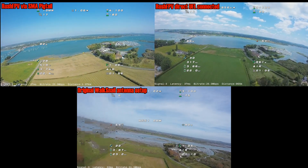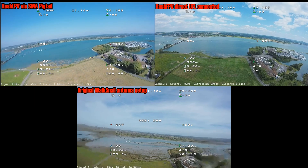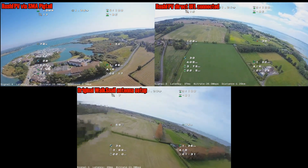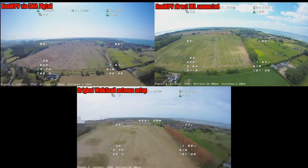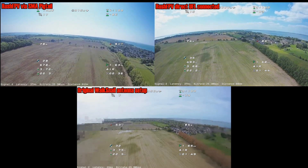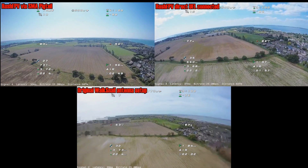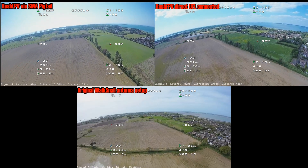Okay, so let's compare — I've tried to sync these up as best as possible, but previously it wasn't that windy so I was flying twice as fast. What you can see here is the directly connected UFL connector when using the Rush FPV one doesn't ever drop into focus mode — it never drops the signal to 2. It's not quite scientific because I've got slightly different heights and atmospheric conditions, but down below you can see the original Walksnail antenna setup, which also has the battery on top, making it even worse. I feel we've got vast improvements over that, at least. But I guess I'll be going back to that direct UFL, as it looks like the SMA pigtail has introduced too much loss. The only problem with that UFL connector is it kind of had a locking thing built around it which didn't fit in very well with the Walksnail, but I'll have a go at sorting that out.